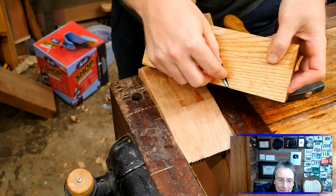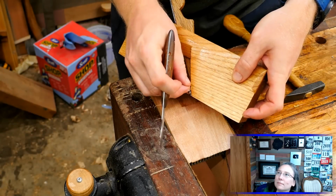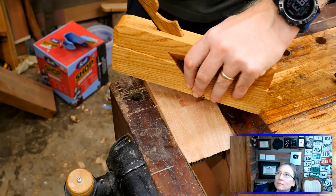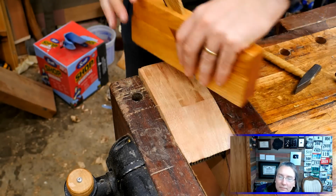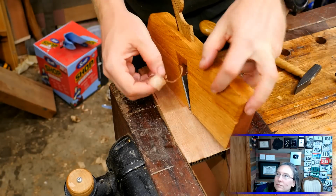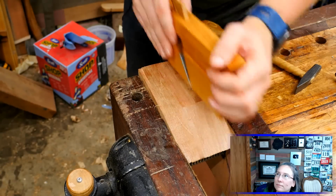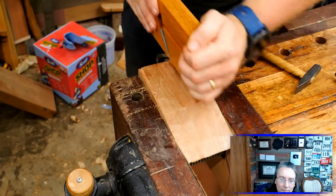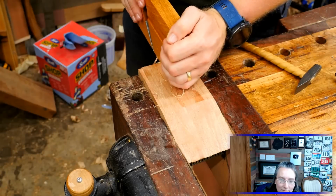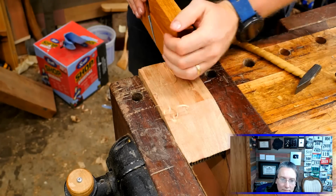Getting a very slight shaving coming through there. Here, pull that out so you can see. Very, very thin shaving, but mostly coming from the backside. But actually pretty close. One little tap more. Set the wedge. There we go. There's the shaving we're looking for. Really nice and thin. So I can do it with just that very, very thin shaving. You just do one here. The first one sets a groove, and then everything else follows in that groove until we get it down to depth. Oh man, this is so much fun.